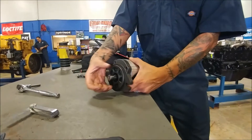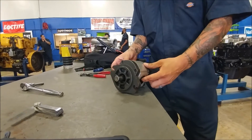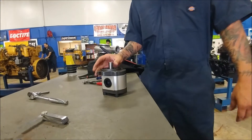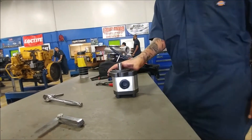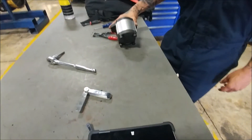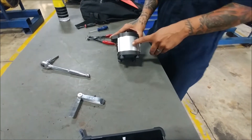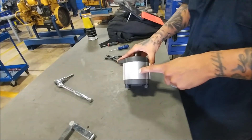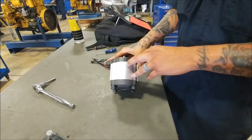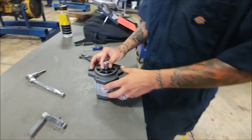This is where the pulley would slide on — you can attach a belt to it and it would start moving fluid from one side to the other, and it would help you drive something like a conveyor belt. This has been a GP F20, which stands for gear pump — F20 means it's a high pressure pump, usually set up for about 2500 PSI. You've got the other serial numbers for identification in case you need to replace parts on this model.